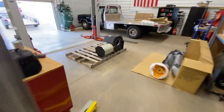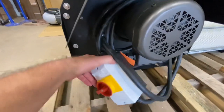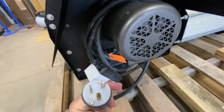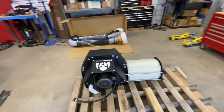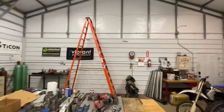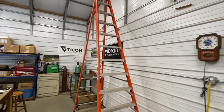Something I didn't really see on their website that I was curious about was the wiring. It actually has a nice heavy industrial switch inline, and just a regular 110V outlet — almost. To make installation easy I might just wire that right into a box, because I'm planning on running a dedicated 20-amp circuit over there and then continuing on with a second circuit in the same conduit over to some grinders I have.